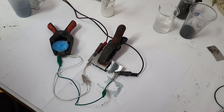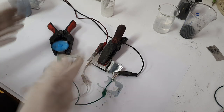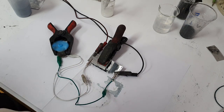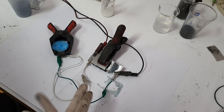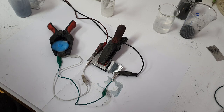For the positive active material I could add manganese dioxide, nickel oxyhydroxide, or nickel oxide, which would increase the capacity and voltage. But in this experiment I hope to get a lower capacity so I can make more cycles. I'm doing this experiment in front of you, and I hope the battery will be empty very soon so I can charge it and see if I can get another discharge cycle.